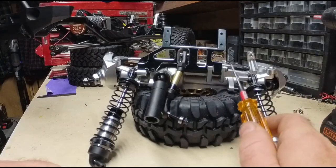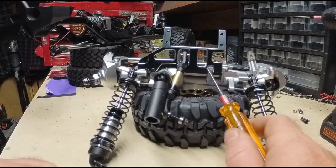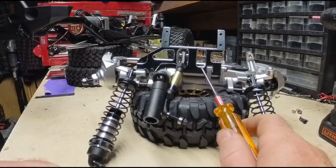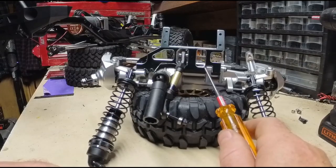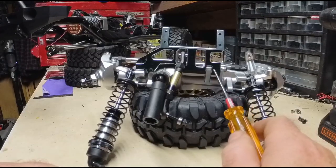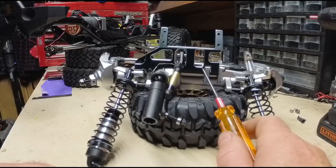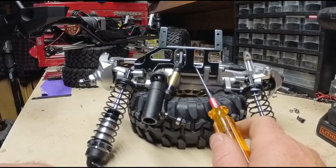So for this little bolt right here, it's an M4 that goes through to here. No matter how hard I tried, I could not hit the thread at all. It's all passed through right to here, and then the threads start. So this is the area inside where it's threaded. The rest of it's just passed through. But I could not hit those threads. I couldn't get this bolt to thread. So what I ended up doing is sending a drill bit all the way to the pass-through and drilling out, maybe, it'd be tough to say if it was even a 16th of an inch, just to get the bolt guided into that hole. And then once it was guided in, it would thread the rest of the way in.